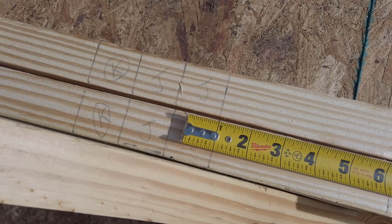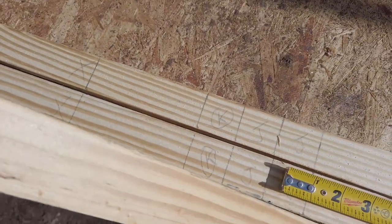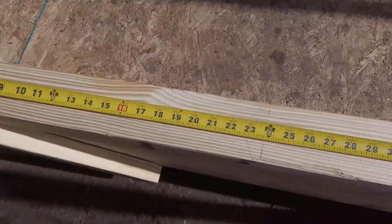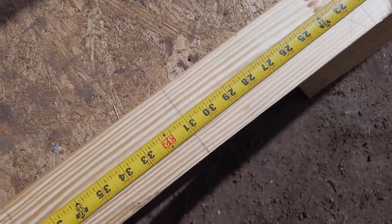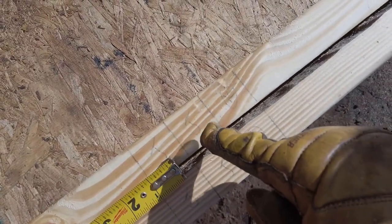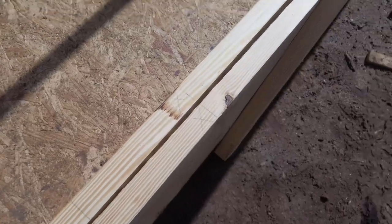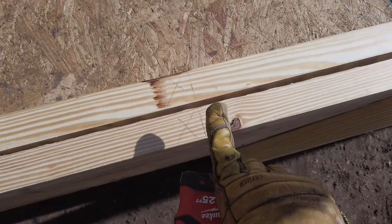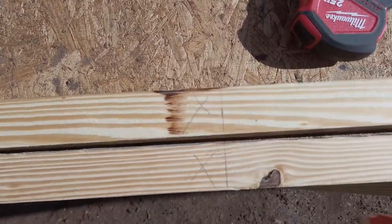Because this is a 60-inch opening I have to have two jacks. There's my first jack, my second jack, and then a king. Some would argue you should set a second king, but this is a storage shed slash workshop, so I'm going to do one king. I did the exact same thing on the other side, just flipped the tape measure — set it to 31, came over to 1, set ahead: first jack, second jack, king stud. Every 16-inch on-center stud in between gets removed for the bottom plate, and those on the top plate get circled indicating they are cripples.